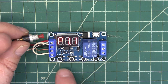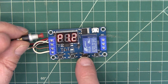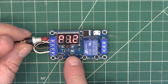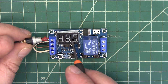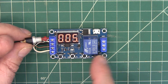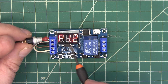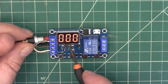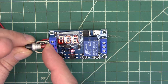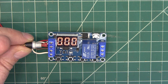Let's try the next one. To get from P1-1 to P1-2, you just hit the up button. Now we're in P1-2. We're going to hit the set button, and that's again our relay activated time, and it is set to five. The only difference between this one and the last one — let's hold down the set button — so now we're in P1-2 and we're programmed to five seconds. The difference with this one is when you hit the button and it starts counting, if you hit the button again, it starts over.